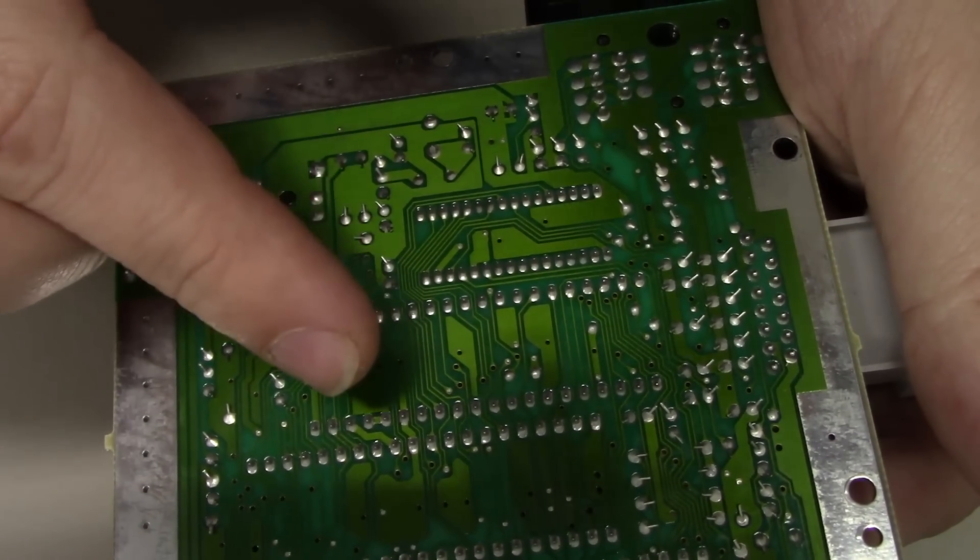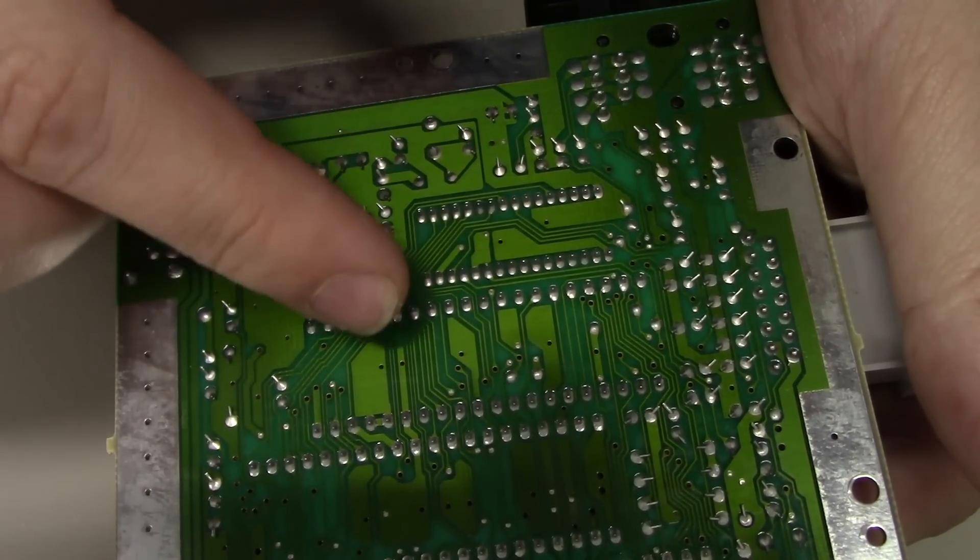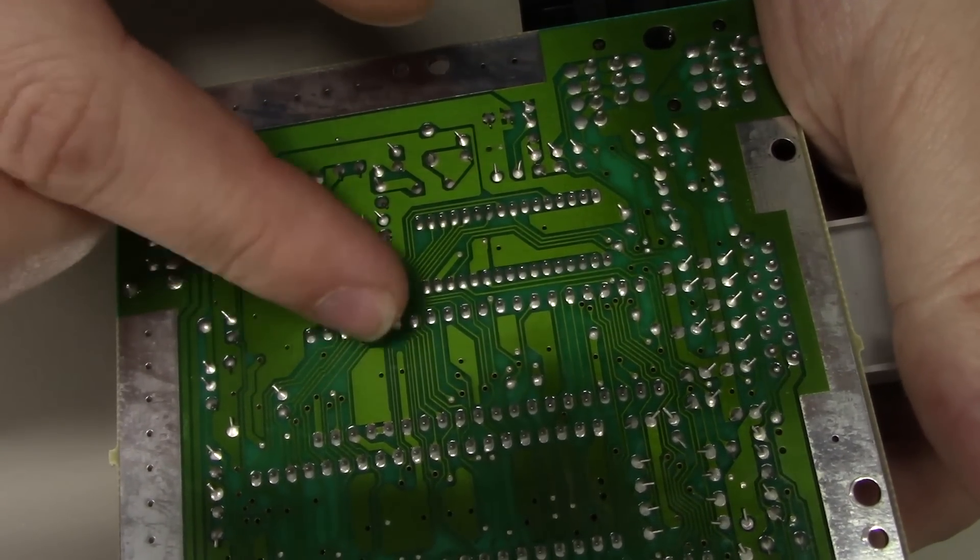You don't have to have expensive tools to do this kind of work. You can spend about $90 on a HAKKO clone — something that's comparable and efficient enough to do this and last a long time. So, point one: avoid solder pumps, avoid any mechanical tool if you can.